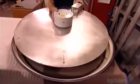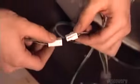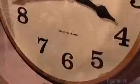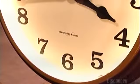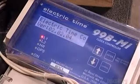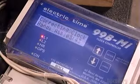The assembled dial now goes into its casing, which has two parts: an aluminum ring called a bezel, around a glass cover known as a crystal. He connects a wire to link the dials so that they'll move in sync. The worker then inserts this casing into what will be a two-dial post clock. Workers then turn on the neon clock light to test it. Once the post clock is installed, a built-in sensor turns the light on at dusk and off at dawn.